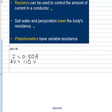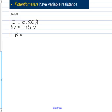What is the current in the same resistor if the operating potential difference drops down to 90 volts? Okay, so we need to first figure out what is the resistance in this circuit. So what formula are we going to use? R equals change in V over I. You're right, I jumped ahead a little bit. R equals potential difference divided by current.